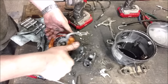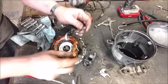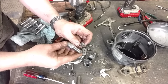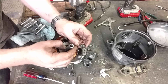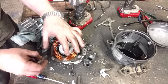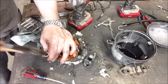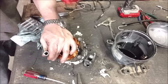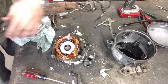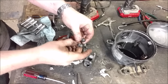I'll just take the whole thing apart. I've got a couple of the bolts loose — I'm surprised they use these specialty heads. It's kind of like a reverse Torx, an E-type. This one's actually like an E12 but it's different — it's completely like a proprietary socket bolt. This is the closest thing that fits on them. It'll allow me to get them apart. If anybody knows what that's called, let me know.